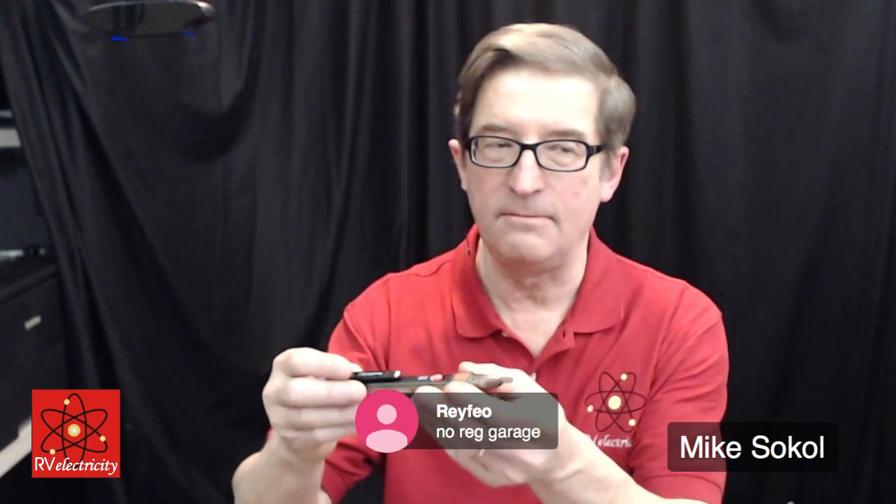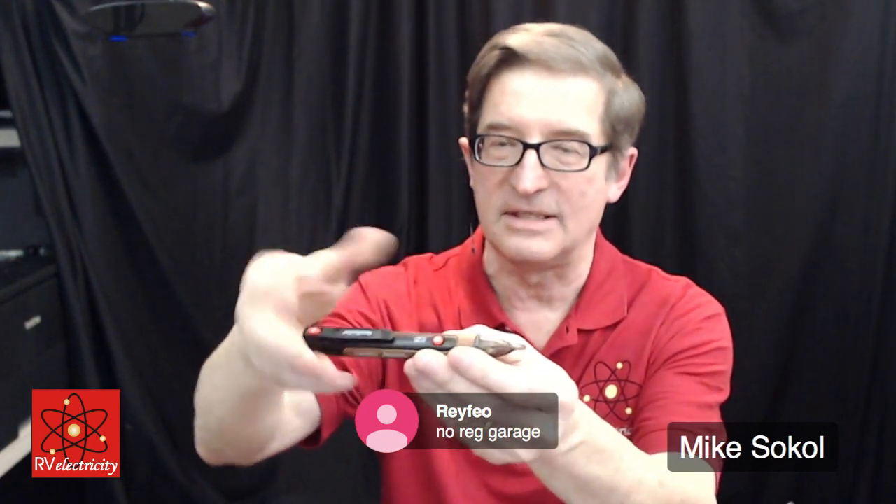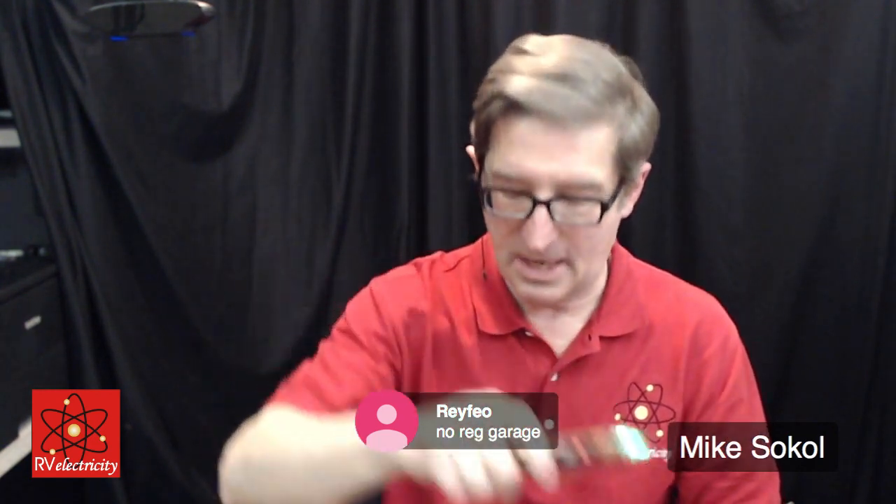He confirms it's a regular garage outlet. I'm going to warn all you guys — be extremely careful. You've seen me use one of these in one of my other videos. What you're going to want to do is get a non-contact voltage tester, turn it on, and point it at your RV after you're hooked up. If you're seeing a hot skin voltage, it means you've lost your ground, and you've got to be really careful because that can be extremely dangerous — in fact, it can kill you if you're not careful.